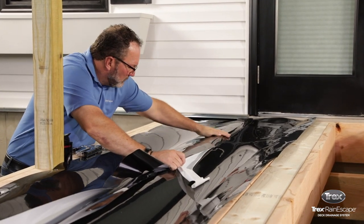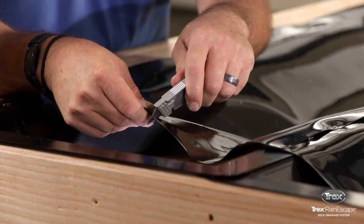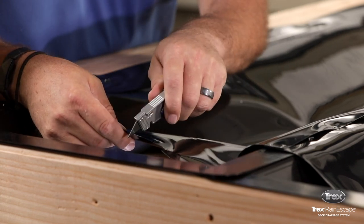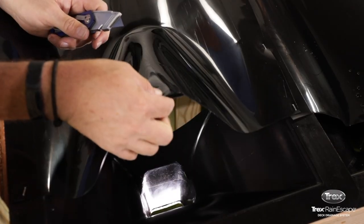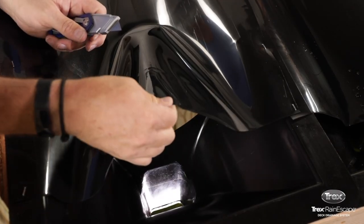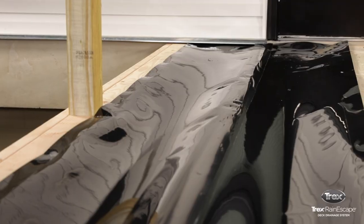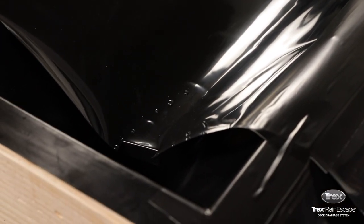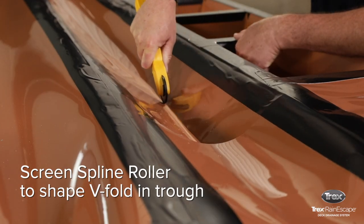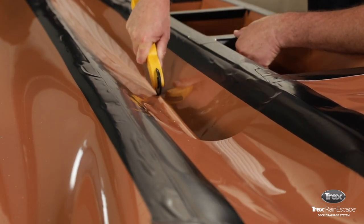Apply it only on top of the trough material. Use a utility knife to cut a small 1-inch by 3/4-inch tab where the trough meets the downspout. Fold this tab straight down. The tab prevents water from wicking up underneath the trough and leaking outside the funnel. The trough should be smooth and with minimal wrinkling. If you find the water does not release properly, use a screen spline roller to create a V-shape. The V-shape will help to properly drain the water.